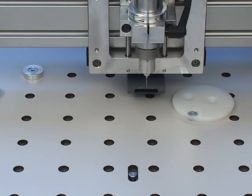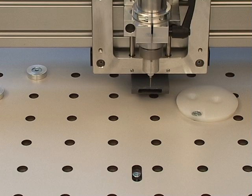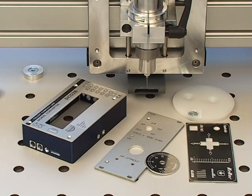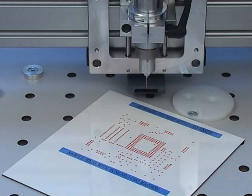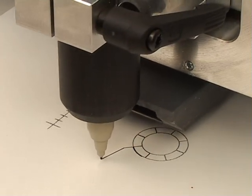With the Bungard CCD you can drill printed circuit boards and all sorts of other materials, carry out isolation milling, contour and cut-out routing and milling. It can also engrave and route aluminium, and process PVC and plaster. Another option is dispensing SMD adhesives and solder pastes.